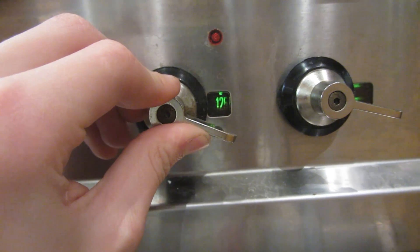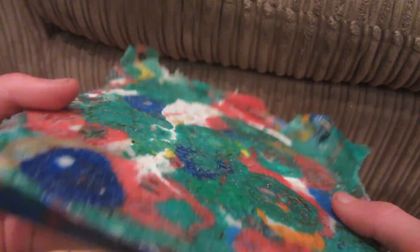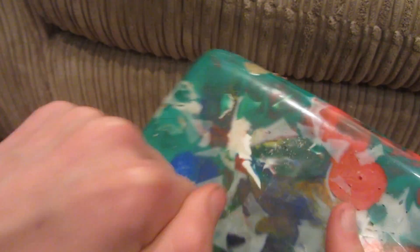I used the exact same cooling process as last time. However, this is what the disappointing results looked like once I took it out of the press in the morning. On the bottom it's very smooth, but on the top you can see hundreds of little air bubbles that must have tried to escape but then got trapped against the plywood. When you hit it with your fist it sounds quite hollow inside. This piece of HDPE is pretty much no good, but at least I can just remelt it back down again.